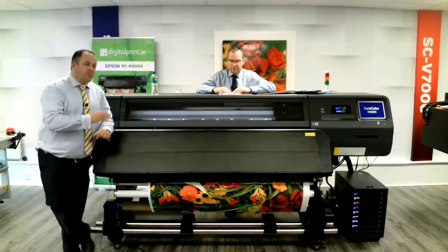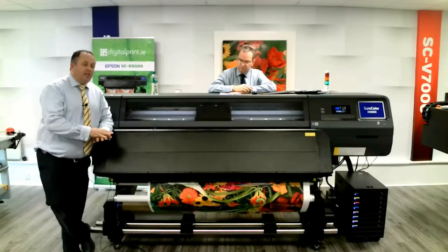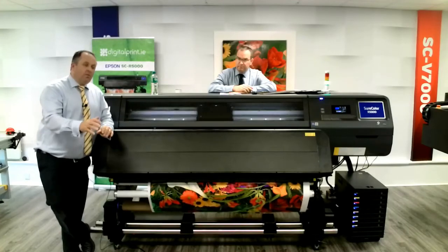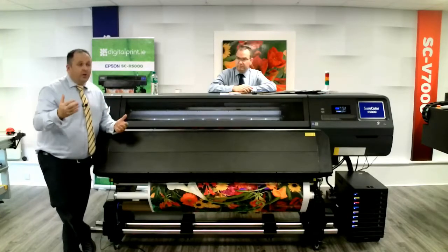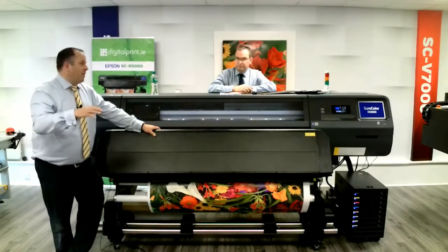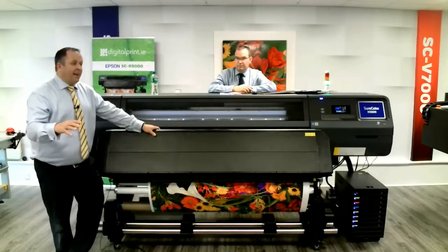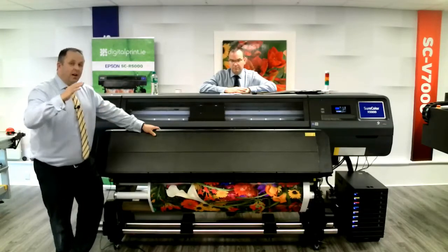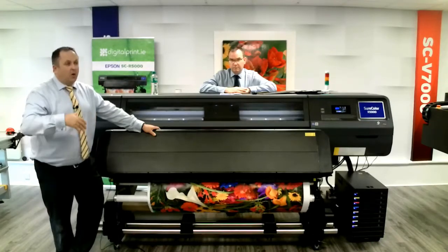Yeah, I think so. Going back to some of the points you've already mentioned, the wallpaper is a really interesting product, because although wallpapers can be done very comfortably on the solvent-based printers, the thing that the resin-type printer really lends itself to wallpapers for is the scratch resistance. Okay, doing a wallpaper on a solvent machine where it's going to go into an area of very low traffic, maybe the back room of a boardroom, might be really good. But if we wanted to put it in a high traffic area, maybe the reception of a hotel or the corridor down to the toilets in a nightclub, where people are going to be brushing off and knocking off it all day long, that's where the resin type inks are really going to lend themselves to doing wallpaper.